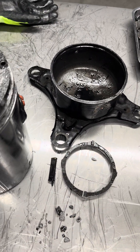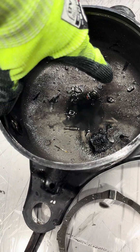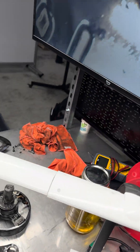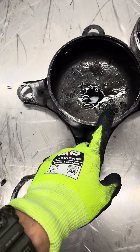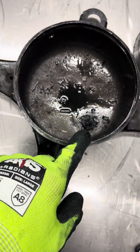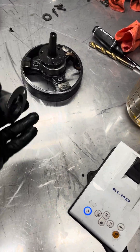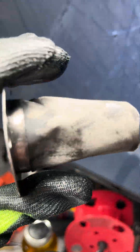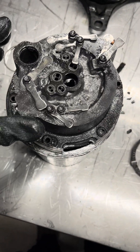But this is where it gets good. Here's the bottom plate. The Daikin compressors have three magnets; LG compressors have just the one — and you can see this one is at max capacity. Let's look at that under the microscope. This magnet is designed to catch metal shavings, but when it looks like this, it's at max capacity. Any metal shavings that now come into the compressor can't be loaded onto this magnet. So what do they do? They go through the oil pump, through the base of the compressor, up through the shaft. They have this screen, but how long will the screen protect it? You can already see it's caught some particles, but like any other screen or metal filter, it will get plugged and clogged over time — and then there's no more oil. Compressors love it when no more oil comes through.